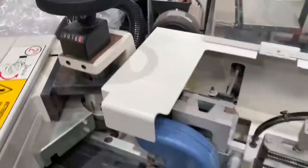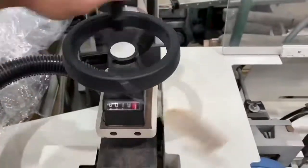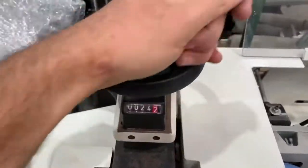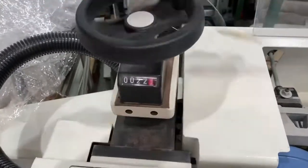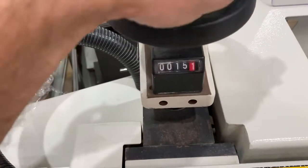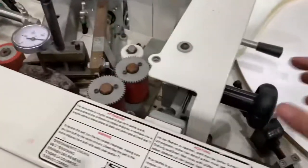Height is adjusted here — when you want to set your board thickness, feed it in until it's holding in position, leave it loose, then adjust this knob to your desired height. If we're going on say 25mm we go straight up to it; if going down to say 16mm we always go past 16mm and then back up — that releases any slop in the thread. You should do this whenever doing any adjustments on the machine, like your trimmers. Then we lock this off.